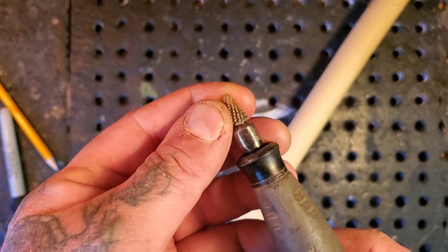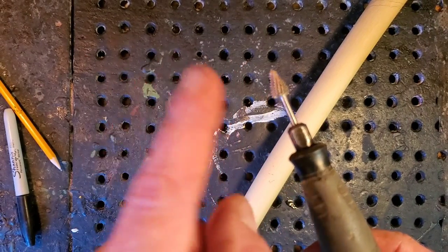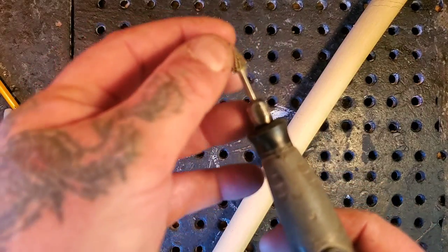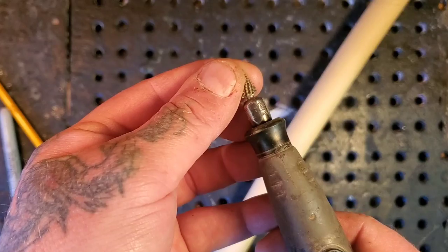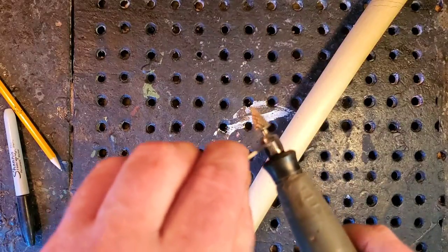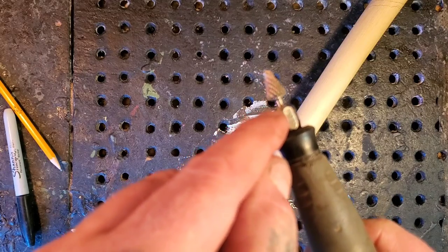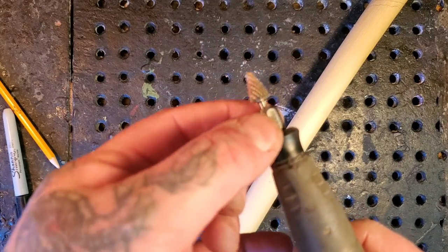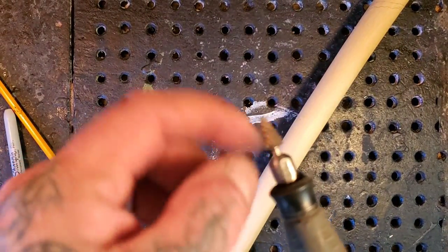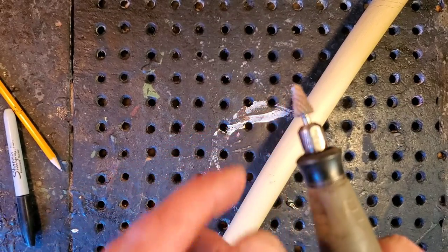But these burrs, you want to push them in all the way. Don't run your burrs like this, guys, that far out and tightened up, because that's how you can bend the shafts on these burrs, or you can screw up the bearings in your handpiece. So push it tight, pull it out a little bit, not even that much, and then lock her up like that. Then you're safe. And if the burr gets stuck in here, which I know because this collet is getting worn out inside here, all you have to do is loosen this up. You can't pull your burr out. You just tap it on your table. It'll push it in, and you can pull it out. I'll show you when I'm going to change burrs what I mean, how this burr gets stuck in there.